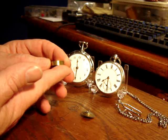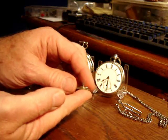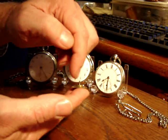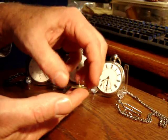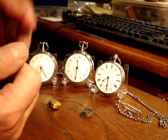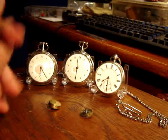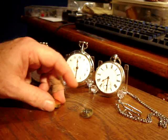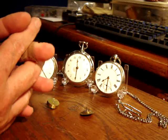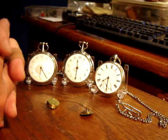The reason for the chain is to equalize the power of the spring. As the spring winds down, these older springs would lose power. So by changing the diameter of the drive wheel — this Fusee cone — by wrapping a chain around a cone-type shape, you are equalizing the power given to the watch such that the power is pretty much the same all the time. This technology was used for about 400 years, from the 1500s up until around the 1840 timeframe.